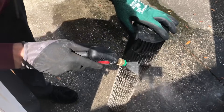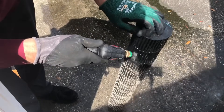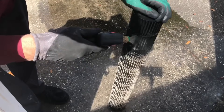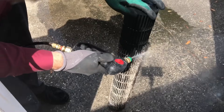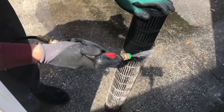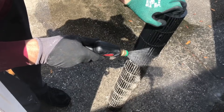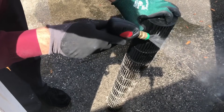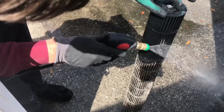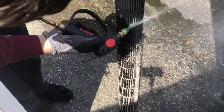It's actually really easy to knock everything off these blower wheels. When it's real bad and you have to clean that coil, I take it off the mini split and bring it out here, because a lot of times when it's sitting in there it spins so freely that while you're trying to clean it, it just ends up spinning and gets in the way of getting a real direct hit where you want. So if it's real easy to get the blower wheel out, I usually will — for cleaning it — and then I can clean the coil and everything else with the bib kit without the blower in the way.